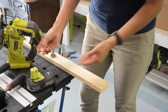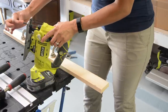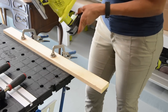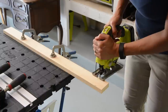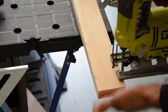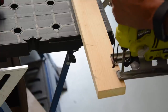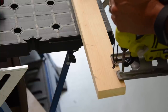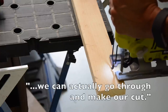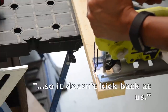We have our battery out and we're ready to put the blade in. Insert the blade, give it a nice tug just as shown earlier, make sure it's tight, then pop in the battery for our first cut. Before you get started: when cutting with a jigsaw, make sure this base is resting on your project — wood, plastic, or metal. You don't want the blade to touch the material yet; get that blade running at full speed before making contact. Now that the blade is at full speed, go through and make your cut. Let the blade do all the work and keep the base on the wood.